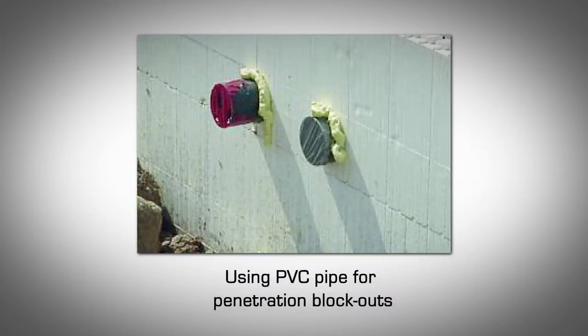Penetrations. Utility penetrations. Penetrations for utilities must be installed after a story has been stacked and before the concrete has been poured. Generally, all wiring and plumbing is run inside the walls by cutting channels in the EPS foam and installing the wiring and plumbing. Wiring for external fixtures is normally run through the wall only at the point where the external fixture will be placed. For details on wiring, refer to Appendix E.